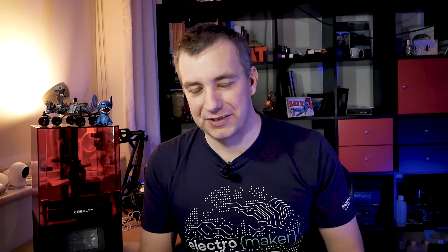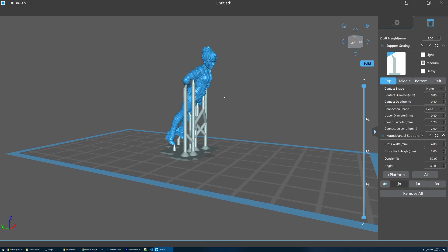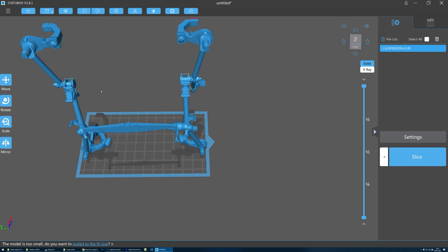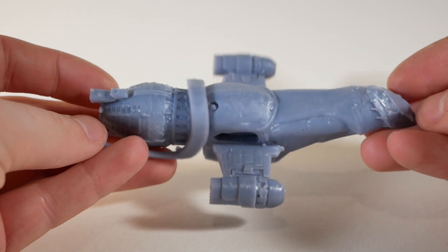SLA printing is all about perseverance — and I didn't mean the rover itself. It's a much different process to FDM printing and you'll have to unlearn everything you know from filament-based printing. First, you have to master the art of orienting your prints to limit the number of islands you'll have to support. Auto-generated supports only work for uncomplicated prints; for complex models you'll have to add supports manually. Too much support makes the print difficult to release; too little results in distorted or missing parts.